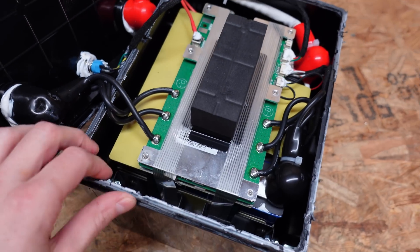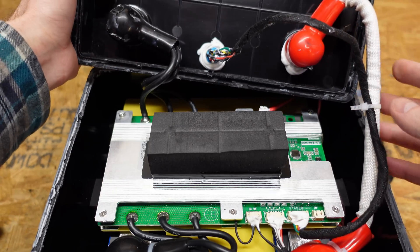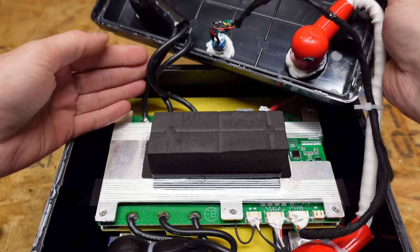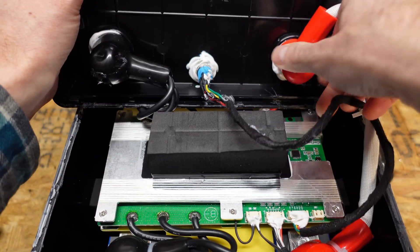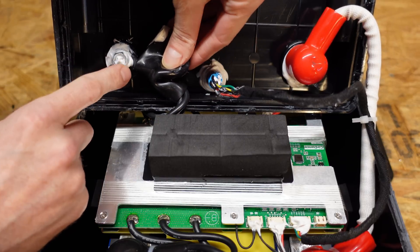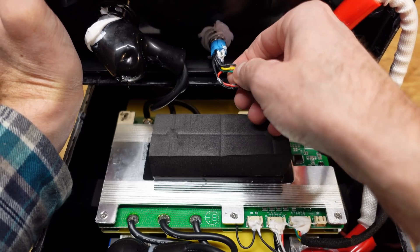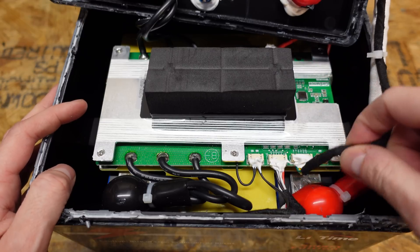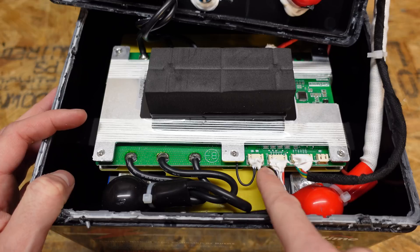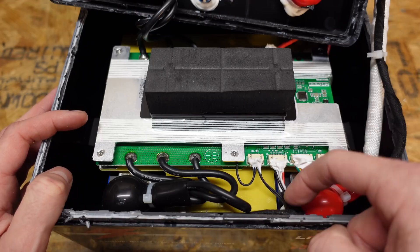Right away I can tell this looks different — this is not a BMS I have seen before. We have three number 10 gauge silicone insulated wires with a 200 degree Celsius insulation rating. There are large rubber covers over both the positive and negative terminals, glued down. Pulling one off reveals a crimped lug bolted down with some silicone. The control wire from the button has five leads going back to the BMS, the center has balance leads, and there appear to be two temperature sensors — one going into the BMS and one going down into the battery.